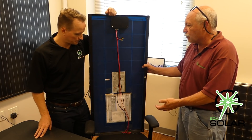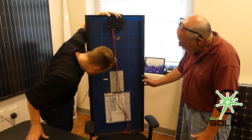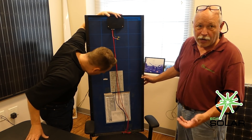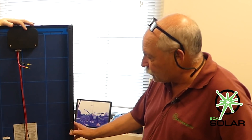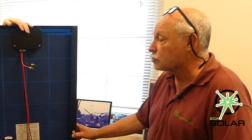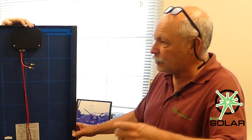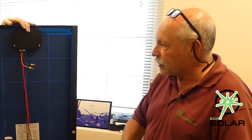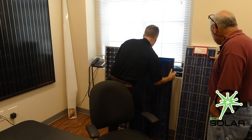In addition to racking systems becoming much more installer-friendly and complete — with fewer screws and code-compliant grounding — back when you installed these, you had to have a ground run to each individual module because none of the racking was UL-listed as ground-compatible. You'd have grounding lugs and copper wire running between all the modules, and when you're doing four modules at a time on a roof, you had to have it all pre-wired before carrying it up.